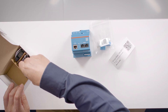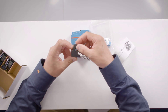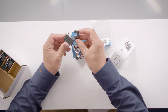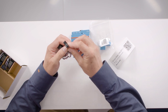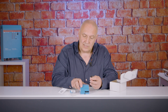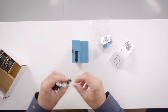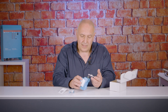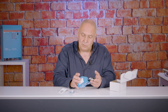Next we have three current transformers. These are clip-around transformers — you can unclip the CT, place it around a cable without disconnecting it, click it back together, and the CT connection goes into the device using a plug. On top of the module these sockets are where the CT literally just clips in. The leads on these are approximately one meter long, giving plenty of room within a distribution board to reach the cables you want to monitor.